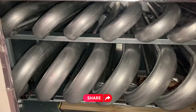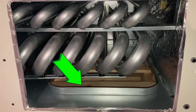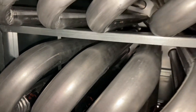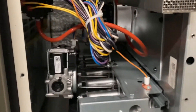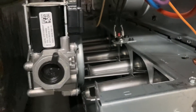Let's start pulling panels. It comes with filters — that's nice. We can see a little bit of minor damage from the factory. Check the heat exchanger tubes. We need to place the cover panel because we're not doing a vertical supply and return — we're doing the horizontal supply and return to match up with the old plenum on the roof. Check the blower motor, burners, gas valve, draft inducer motor, pressure switch, and so on. Make sure everything looks good — no loose connections, no broken connections, everything's all there.